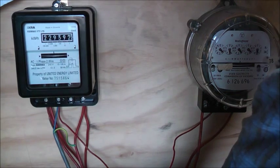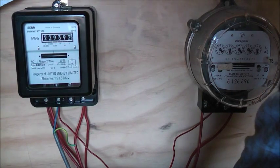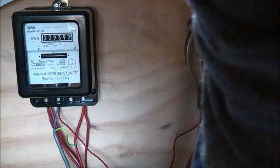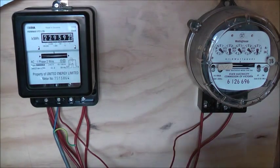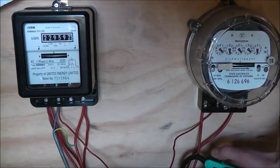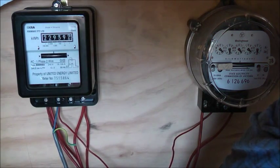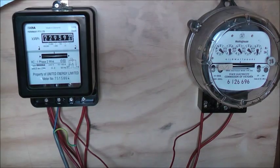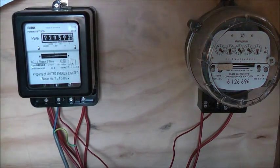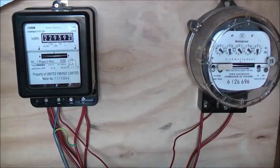One's going slower. 10 amps. One's going a bit slower here. 15 amps. That's 90 amps to that. I've got some losses here, one's going faster. I've only got nine and a half through there, 8.7 on my main one, 94 amps — I've got some losses. I have to turn this off and correct my losses. I'm losing a lot through this cable — I'll have to shorten this test cable out, got a lot of current drop there.